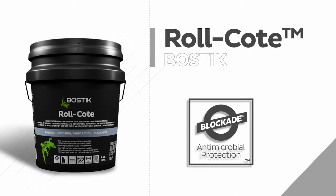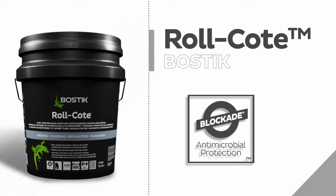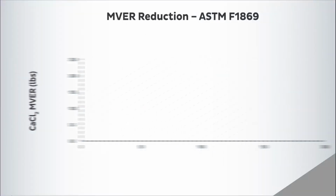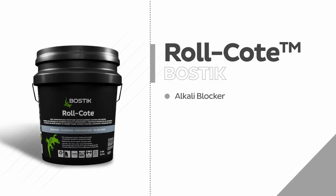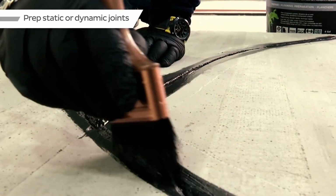Contains Bostik's blockade antimicrobial protection, which inhibits the growth of bacteria, mold, or mildew on the surface of the cured membrane. Will reduce moisture vapor emission rates from up to 25 pounds per 1,000 square feet for 24 hours to less than 3 pounds, or from 99% to 75% RH. It will block concrete alkalinity and can also be used to prep cracks and joints.